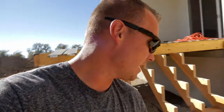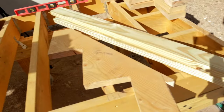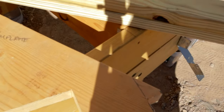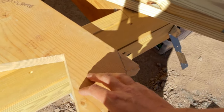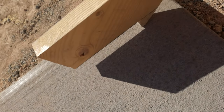In order to mount these to the concrete you've got to make sure you have wood that is approved for ground contact, so I ended up buying these two-by-fours here that are approved for ground contact. What I did was notch out my template for the stringer — since this stringer is going to attach to the deck, I notched this piece out at the bottom so these two-by-fours sit in there. The two-by-fours are just slightly taller than the notch so this never actually touches the ground. I will then drill a hole through them and attach to the concrete pad.